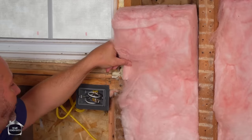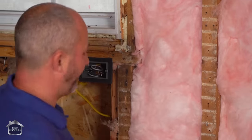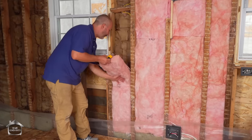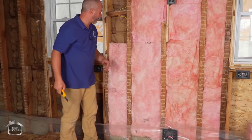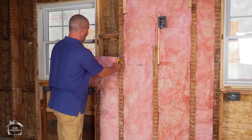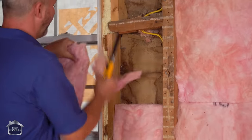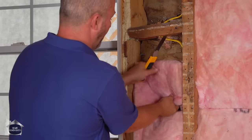Even around this little spot where my framing is adjusted, I want to tuck it around. All I do is put a little mark on the back of the insulation, split it open, get the insulation up and around, and let it envelop the wire — nice and quick. Don't be afraid to use little bits of off-cuts. As long as you're cutting it a little longer than you need, you can put piece after piece after piece and it'll fit absolutely perfectly.